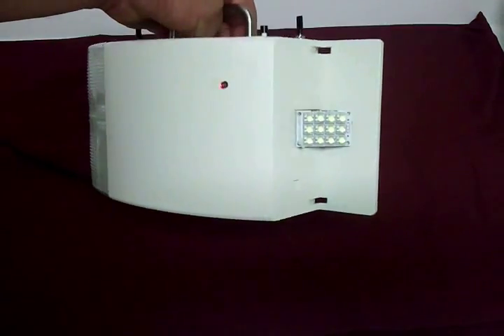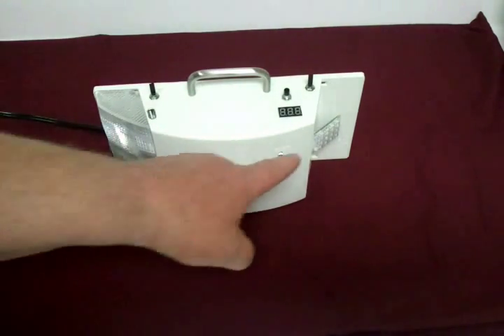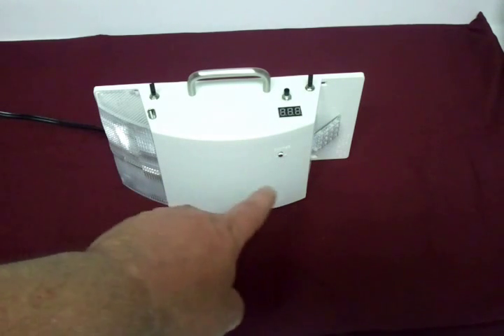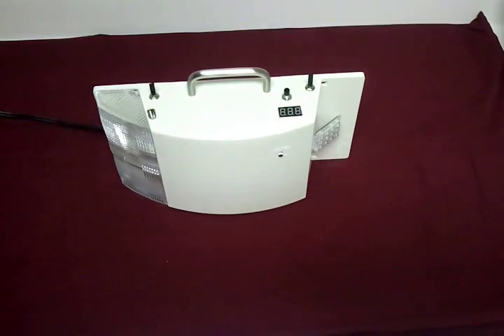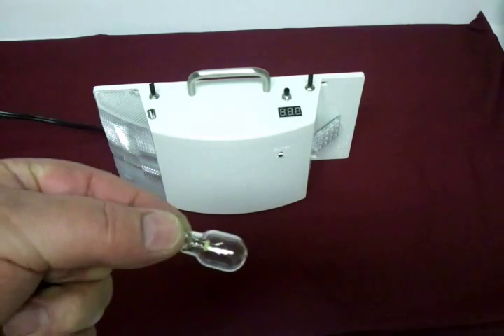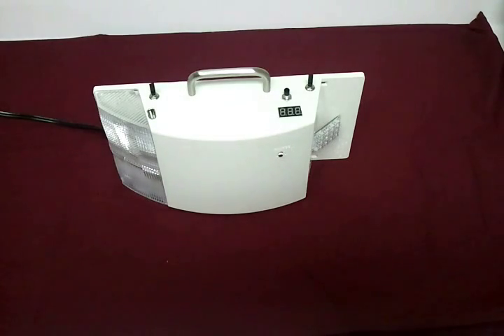That light panel is designed to run at 3.5 to 5.5 volts and is rated at 1 watt. With one on each side, I have approximately 2 watts of lights running — versus two of the original bulbs, which were consuming almost 11 watts. That's an energy saver.